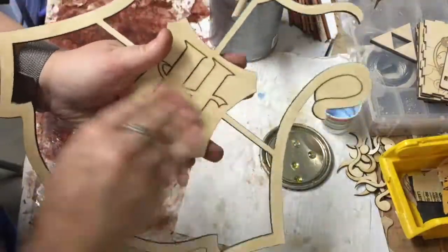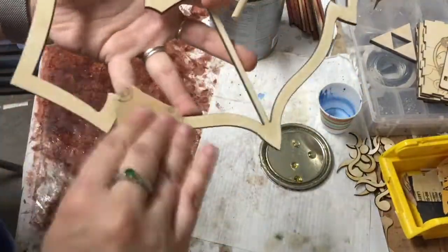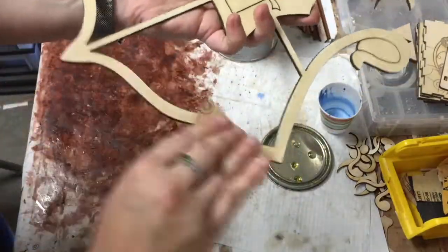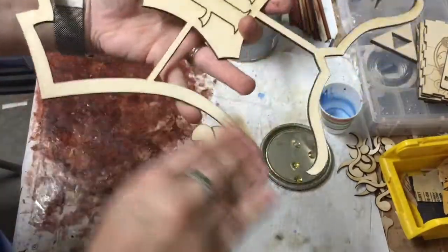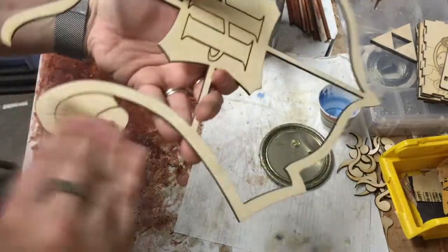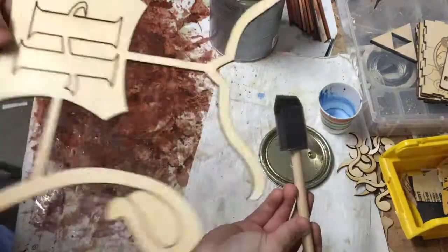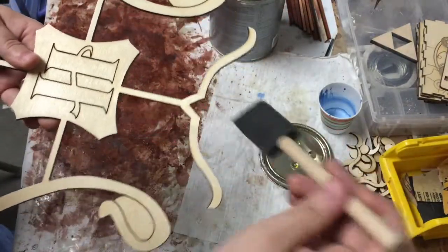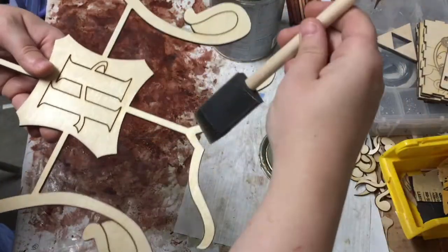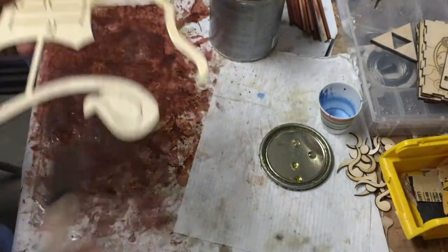I hand sanded it after the first coat of polyurethane had dried. I think I used 400 grit sandpaper — gets it nice and smooth. After that, I apply another coat of polyurethane, and if I feel like it's necessary I'll sand it and apply a third coat, but usually I don't need to because if I'm careful and do it real gentle-like, I can get a really good shine with just two coats. Smooth and slow brush strokes — if it goes on there real smooth, it dries smooth.